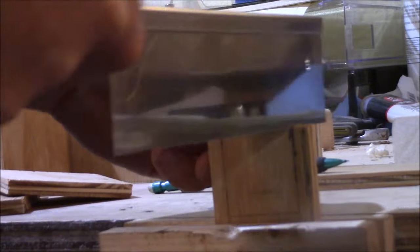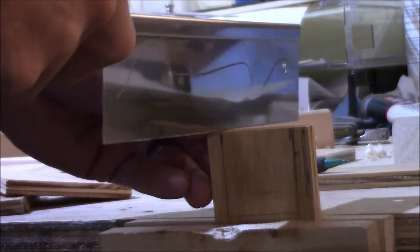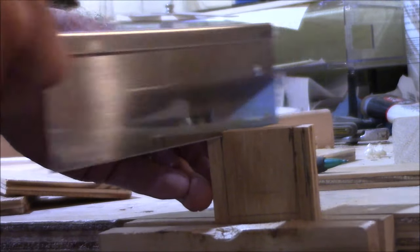Essentially this is where you're going to use your coping saw, the only time you will. But first we're going to try to cut as straight down as we can, because we don't have much. You can't screw this one up. You don't have much space on each side of the carport for this piece, so it really has to be pretty much true and straight, just so it doesn't look bad. But once you get that done, you're going to use your coping saw.